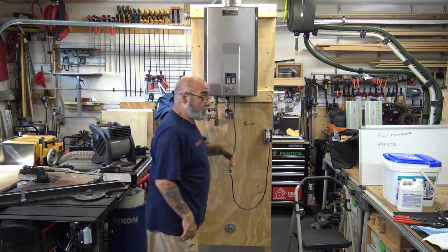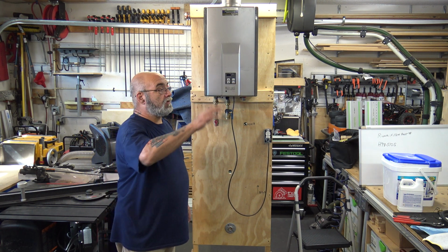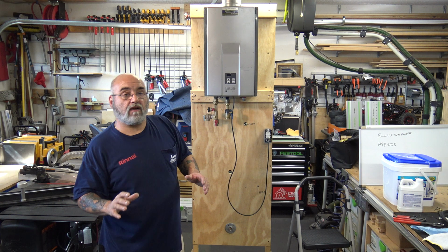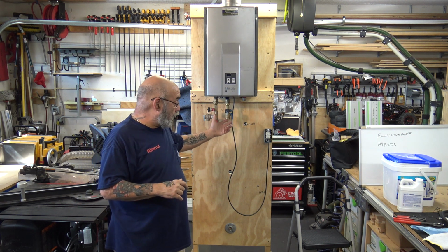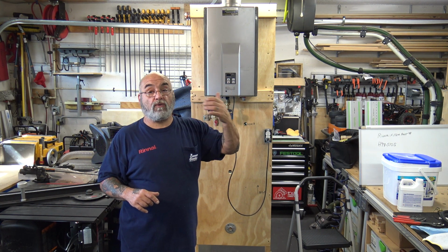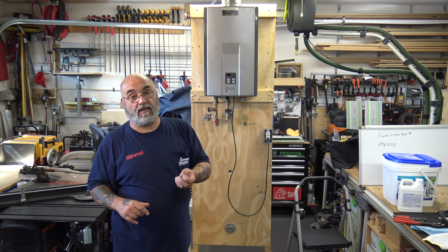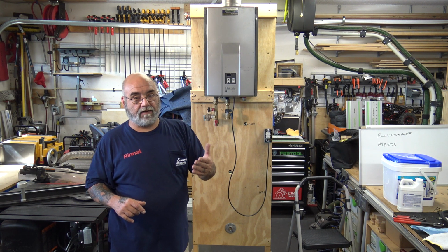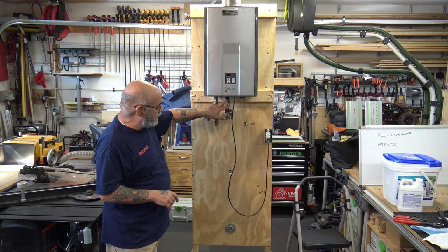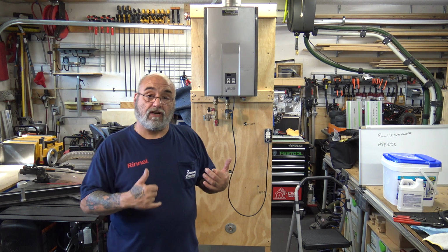If it's an interior unit, it comes with a plug. You'll hear the water servo valve activate. Now go around and test fire the fixtures. Because you had the water off, you might have disturbed some junk. It could have gotten up into a shower head or an aerator. And now when you leave, an hour, 2 hours, or the next day you get a phone call, hey, one of the fixtures is not turning the tankless on because there's gunk in it. Better you're there, better you fix it and clean it. Okay, so now you test fire it, everything works, make sure you got no leaks from the filter, and that's it. That is the procedure to flush a tankless.